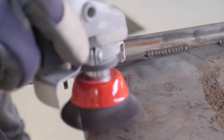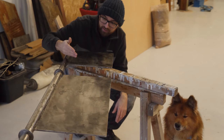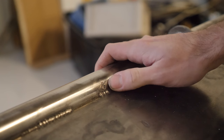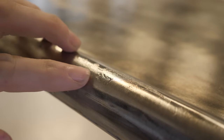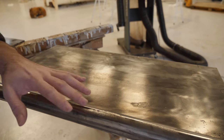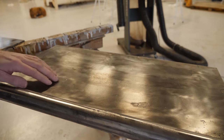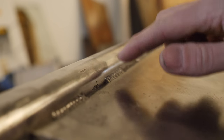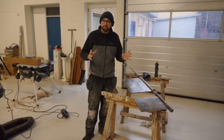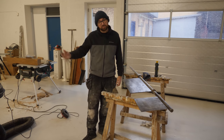After that little cleaning session I can certainly see that there is some corrosion here. If I bring you guys a little bit closer, this is what that corrosion looks like — it's about a millimeter deep. There's also some pitting here and here on the rudder stock. There are areas like that scattered all over the place and on the plate there are some pitting and other kinds of defects. The funny thing is when I saw rust oozing out the bottom of the rudder what I was concerned about were the welds, but they look pretty decent. I think we'll circle back to the innards of the old rudder a little later. For now let's get to laminating.